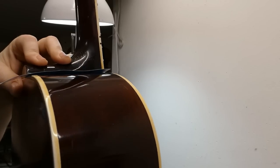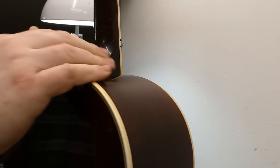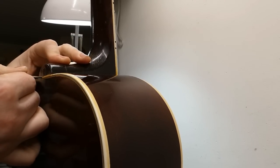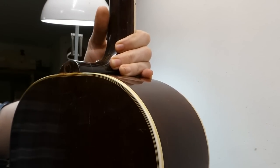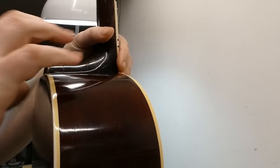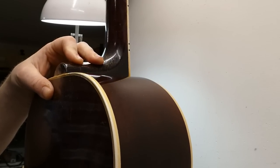I'm not the first person who's tried to reset on this guitar — there is evidence in various places. It's kind of a delicate thing. There's a balance between going too far and ending up with too tall a saddle, and being a little timid and not taking enough off. If this was reset 25 years ago, they could have taken a bit more off. But it's nice that they were erring on the side of caution.